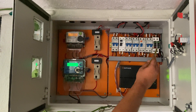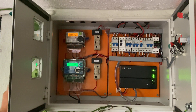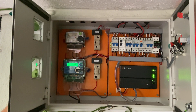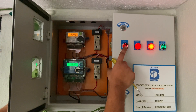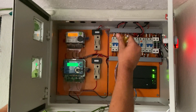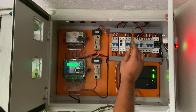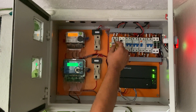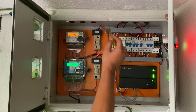From this ELCB, the power gets into the SPD. If there is any surge coming from the power utility grid, the SPD essentially grounds it. It is very important to give a thick wire and ground it properly. Again we have rated this SPD for 275 volts. The ELCB, SPD, and MCB are in parallel. This is the main MCB — one can trip this to isolate the house, or trip the ELCB. The solar from our rooftop gets into the ELCB again, so if there is any flow of current through a structure or any live part touching metal, this ELCB will trip and isolate both the inverters and the loads. We have an MCB and ELCB, and before the power gets connected to the grid, it flows through a generation meter and then through our 20 amp fuse into the main utility grid MCB.